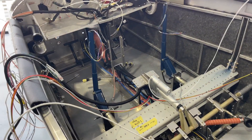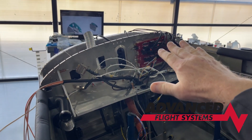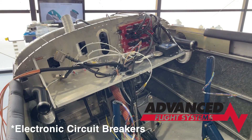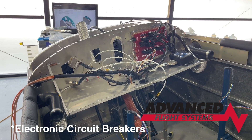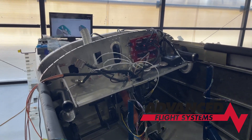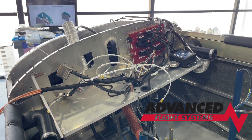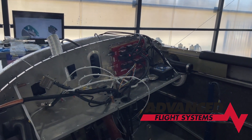This is where I am — I'm just sorting out all the wiring. It's really nice with the Advanced Flight Systems ACM — Advanced Control Module. What it ultimately does is remove all the circuit breakers. If you notice when I was over at the panel, the only circuit breaker on there is for the alternator. Everything else is internal. I can look on the EFIS at each individual component and see how many amps it's drawing, which streamlines everything. I mounted this here because I can take that plate off by the iPad mount and reach in to adjust anything.